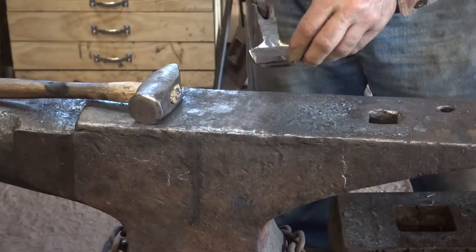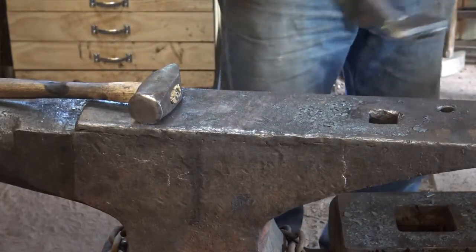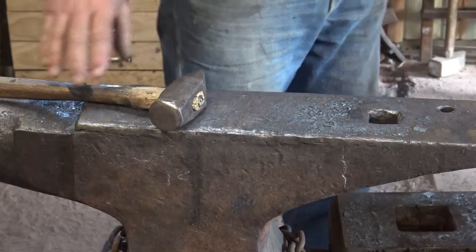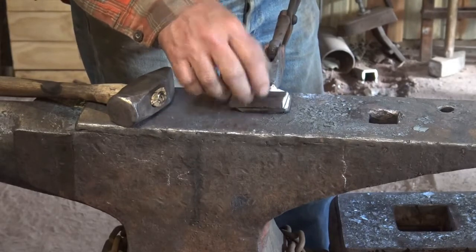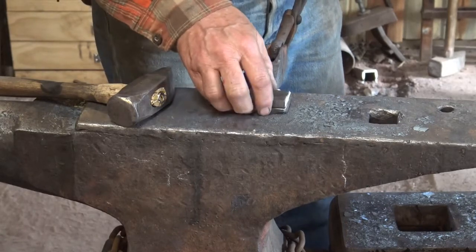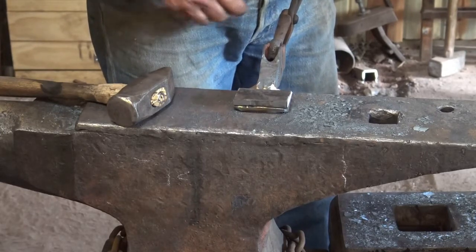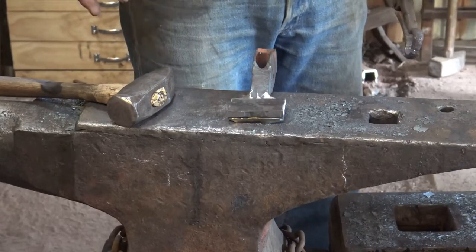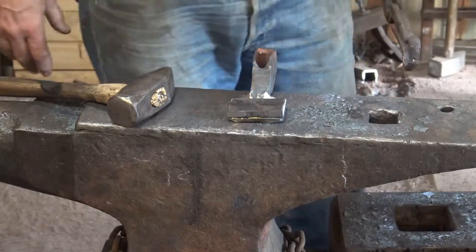You can balance this well enough so that as you come out of the fire it stays put, but you can see that it has moved just a little. I'd rather not have that happen, so I'm going to take a contemporary approach and use the MIG welder to put just a couple of little tack welds on there to guarantee that this doesn't move when I come out of the fire. Those welds are not part of the final product — they'll be ground out. They have nothing to do with the finished adze. It's just a way to hold this until I forge weld it.